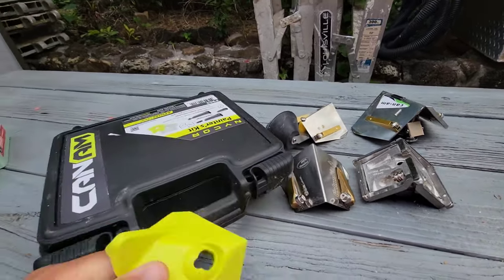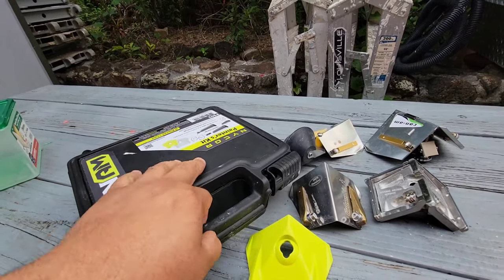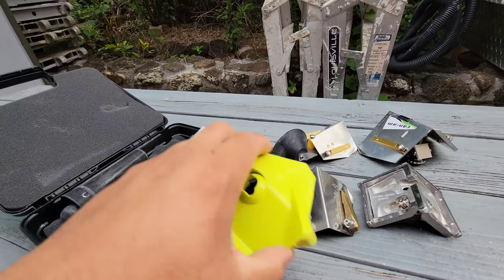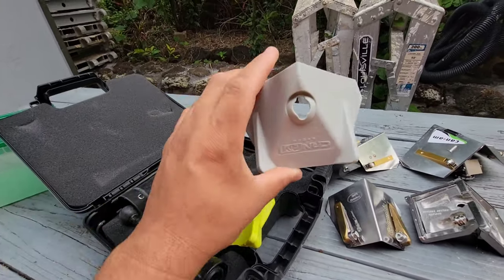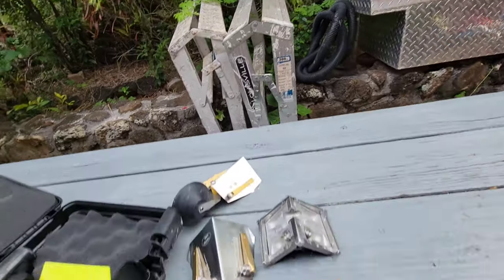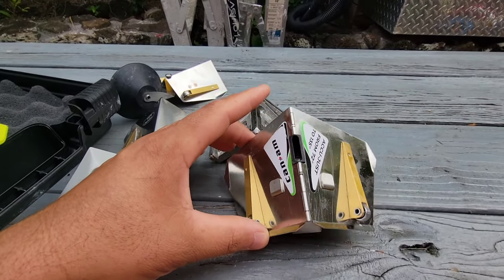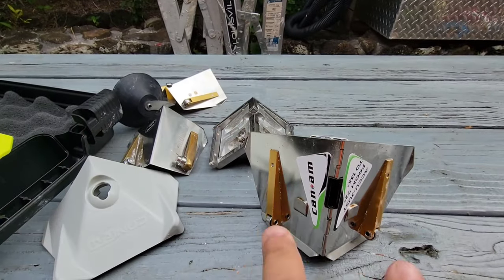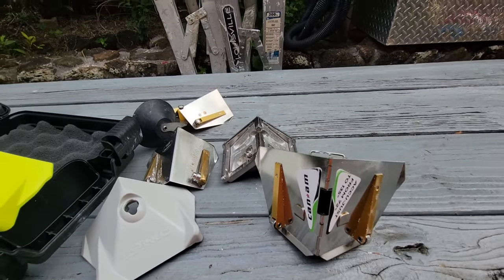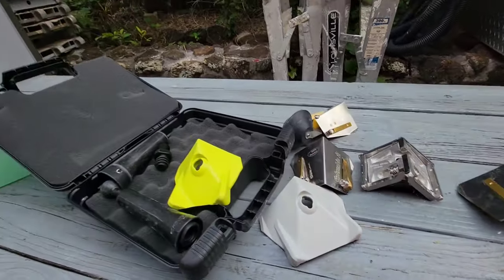So this pack right here, perfect alternative if you only do renovations and that kind of stuff. Or if you do drywall occasionally, perfect. It's only $100 and it comes with this, which is more for bedding the tape. If you put mud with the compound tube, you could actually coat it out, so it's wide like the Can-Am, which is pretty much what this flusher would be for. I think it shines if you're into using the tubes and you apply the mud first, and then instead of hand coating, you use this to coat it out. But since we rarely use tubes, unless it's a small job, this one's not gonna get too much use. But anyways, enjoy.